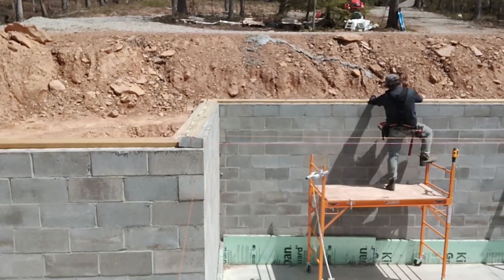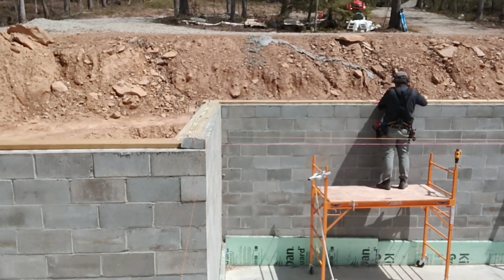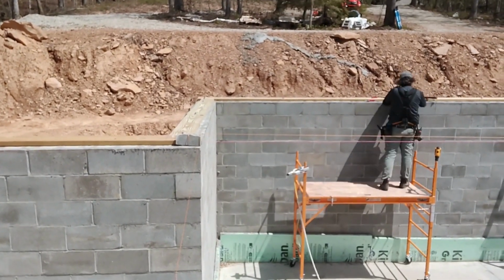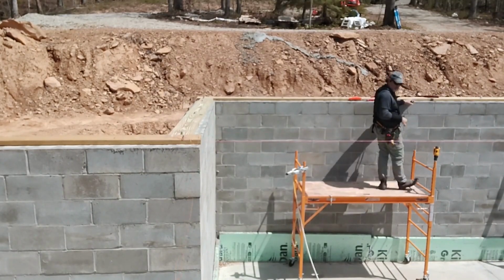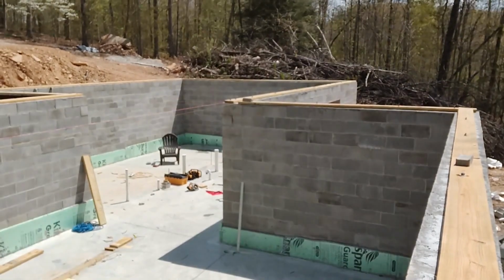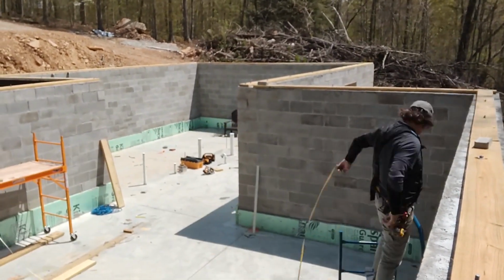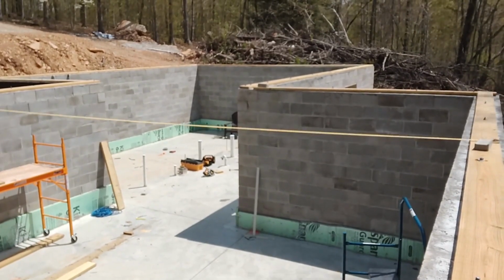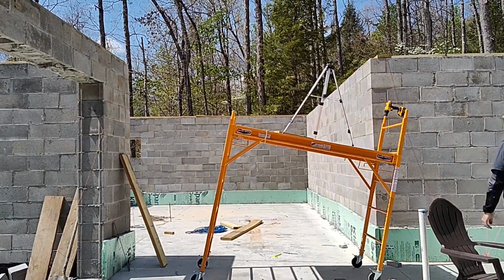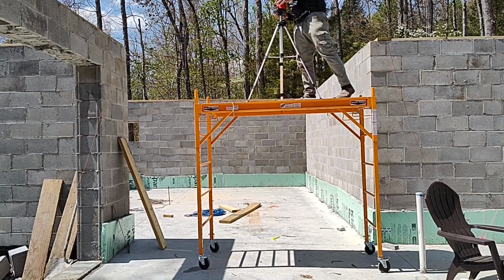on the foundation. And then once I get fully around and everything is dry fitted and secured, I'm going to re-measure, and we'll see a little bit of that, all of the parallels around the entire foundation to make sure that they're exactly where I want them, at which time I will go back and permanently adhere the sill plate to the foundation. Up to now, I've been mostly focused on how square and parallel the sill plate is, but the other important piece is how level it is.